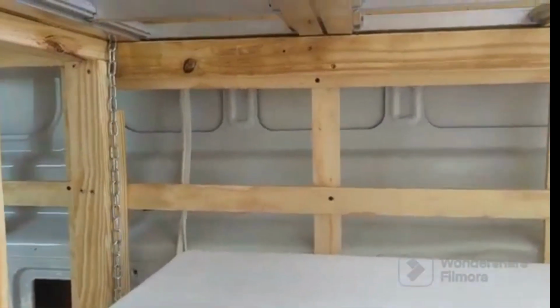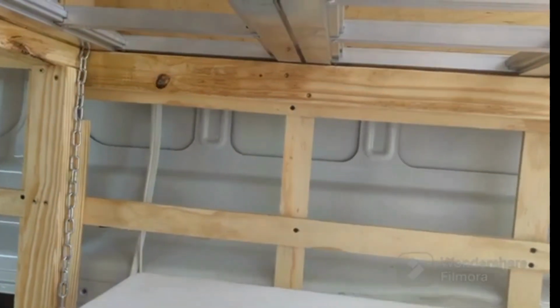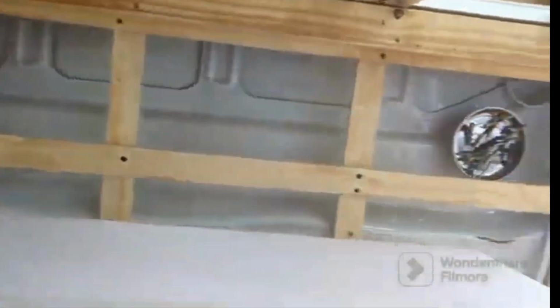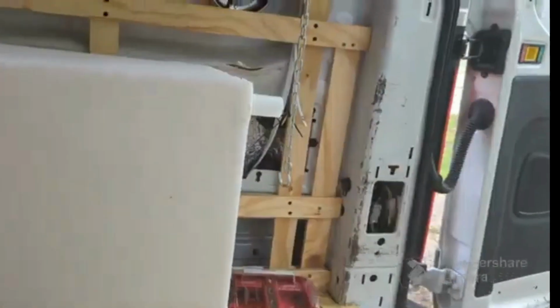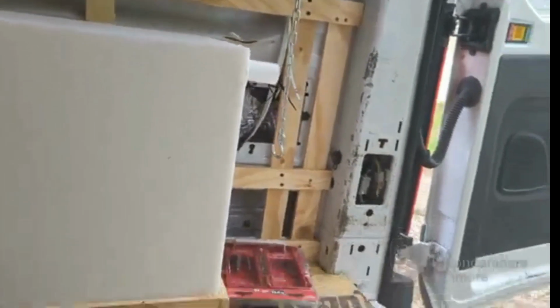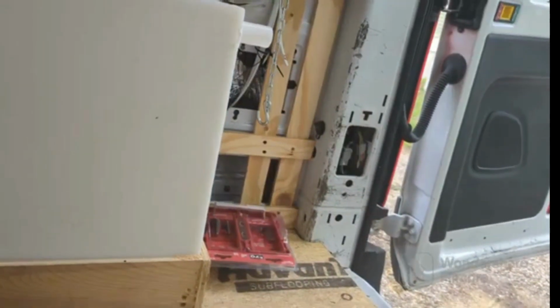And so then above here on this back wall, I'll have a piece of 1/2 inch ply, which I will mount the pump and the accumulator. And then back here, I've got now this much space, about 12 to 14 inches, which will allow me to run my supply line, my vent, my fill line, my vent, my supply line, and my drain line into a box that we'll frame around. We'll be able to put a shower manifold on the back.